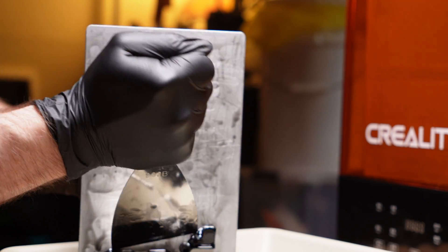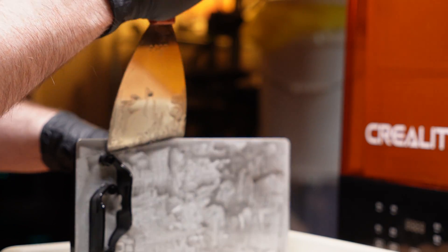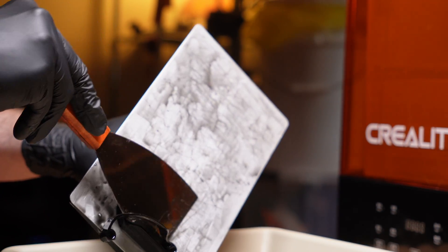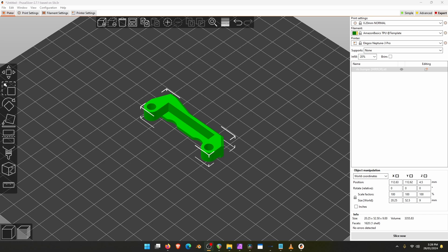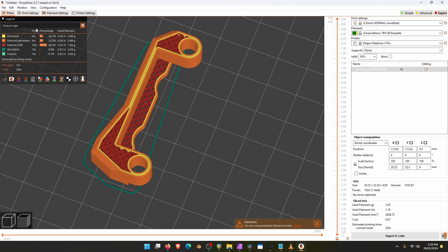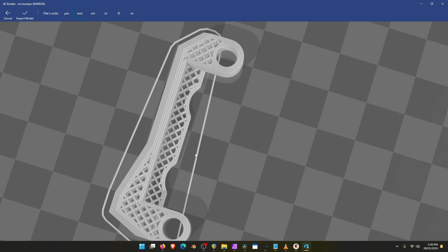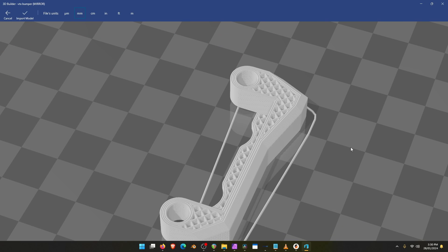I've only ever printed with a 95A shore hardness TPU. Maybe what I just printed was like a 75A or 85A or something — I don't have the experience, I don't know for sure. I'd be interested to hear your experience. Maybe you can tell just by looking at the behavior of this resin — where do you think it lands on the shore hardness scale? Next time I think we'll try one of those tough resins and modulate the resin properties using a really cool PrusaSlicer feature — the ability to export G-code as a model, as an OBJ, which gives us 3D models of the toolpaths. That could work really well for resin. We'll come back and do that in another episode. Thanks for watching, subscribe and all that.